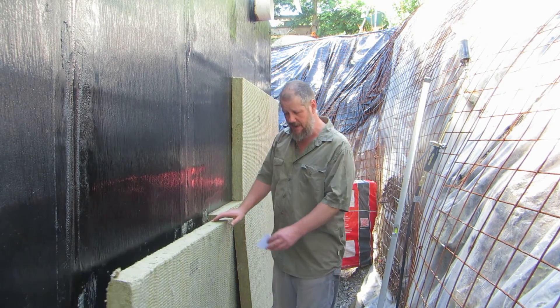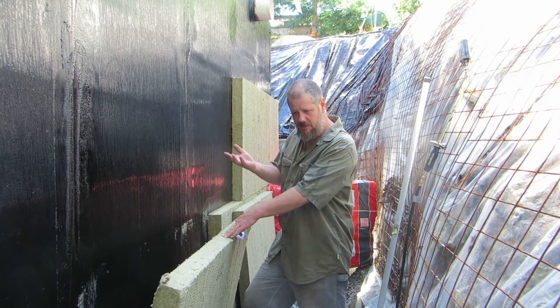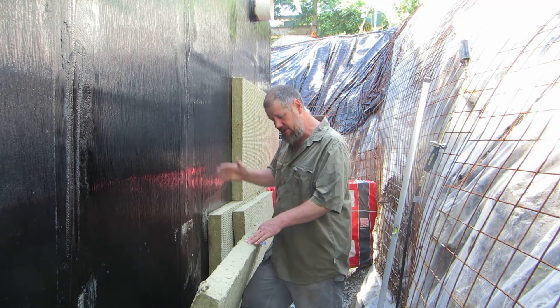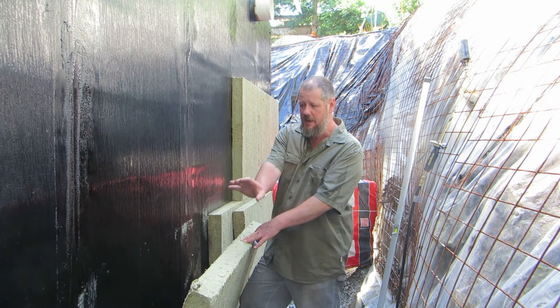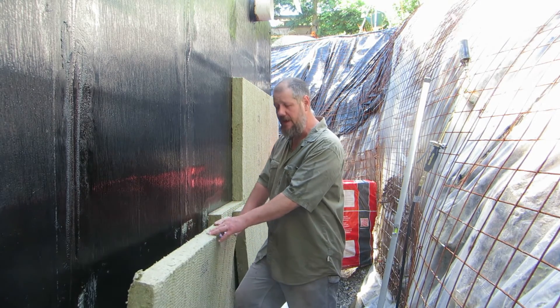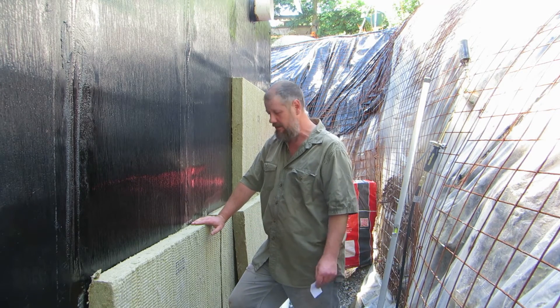Because I have a curve at the bottom — the fast-foot makes curved profiles a little bit harder to deal with — and because I want this to be tight into the curve, I'm going to start by only applying heat at the top foot and letting it just hang, and then the backfill will push it in tight later on.